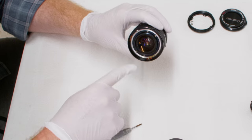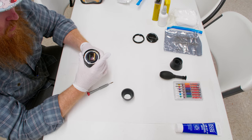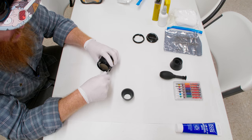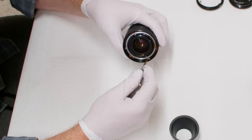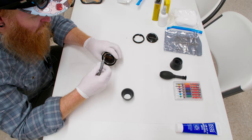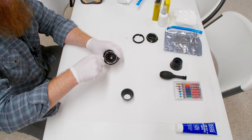From there, this lens has a very contact-cemented set of screws holding the focus ring on. That's nice because when you set these up with follow focuses — especially wireless — you don't want them slipping when you're racking focus. We're going to remove these three screws. Often these screws have tiny little washers on them as this is a pressure fit. They're very, very small, so watch for them.